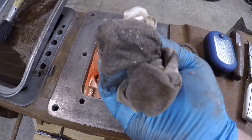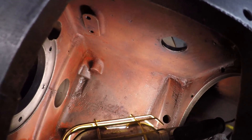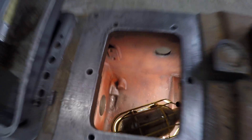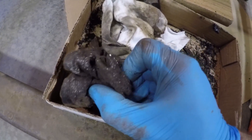You can see a whole lot of glitter coming up from the bottom of the torque amplifier compartment — still a bunch more way down in there. This likely means there were some pretty severe failures in there at one time. Even more came out of there — got to get it clean though.